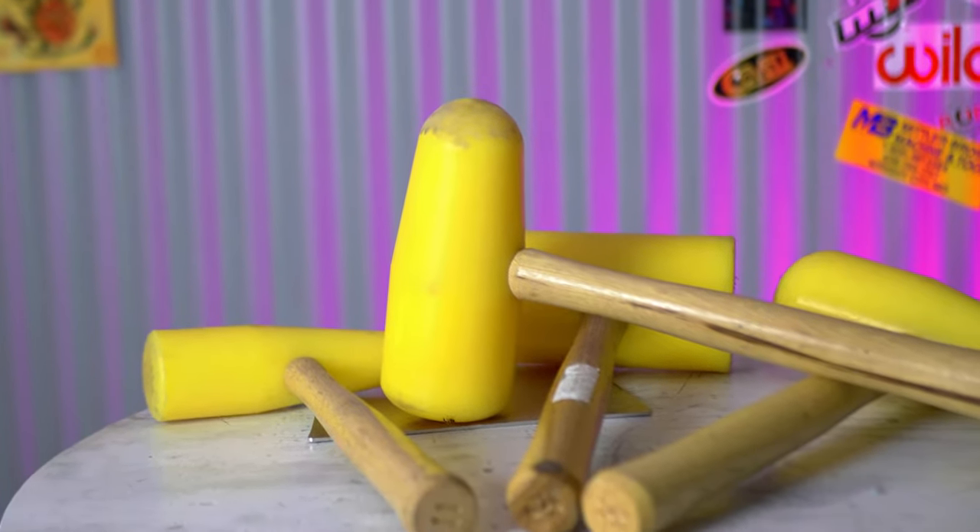I also use this barrel mallet for flattening out pieces — as I showed in my hammer forming video making a speed blister with a flat flange around the edge. To get any wrinkles out of that flange I would use this barrel mallet, probably resting the barrel mallet against the flange and holding it there, then using another hammer to strike on the back side of the barrel — that way I only have to control the striking hammer. You do have to redress the face of these hammers once in a while as they get marred and dinged from wrinkles and edges. I generally break out the DA and reface them just as I do with my body hammers — it goes quicker and easier since they're just plastic.